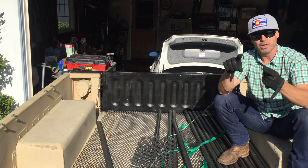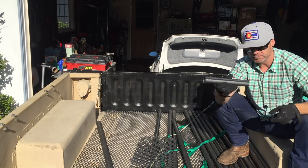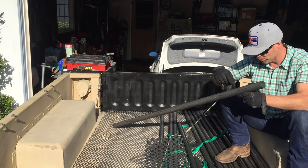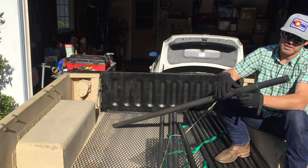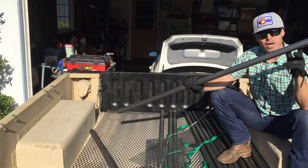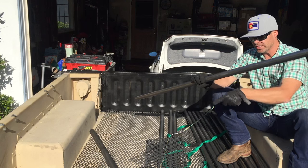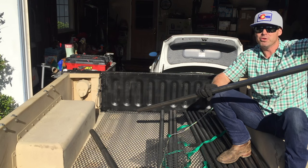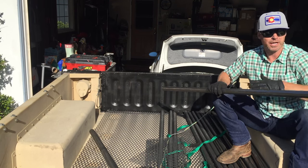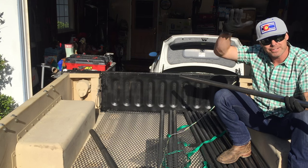What I discovered up there was 1.5 inch diameter, 0.095 wall seamed tubing. Here's a scrap piece. The 1.75 0.095 DOM tubing sleeves really nicely — I've got about a 32nd of an inch play on either side. This will be my upper telescoping piece of the platform. It will sleeve inside the DOM tube, 16 inches up, 16 inches down, for a total overall height of about 32 — probably closer to about 30, since I want about two inches of overlap in the tubing itself. I'll drill once I've got it in position and put a pin in, with some sort of assist lift to help with the raising and lowering of the rack.